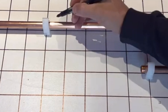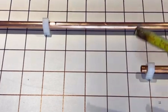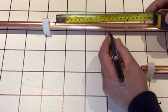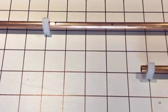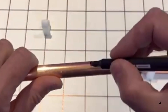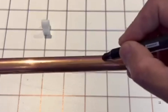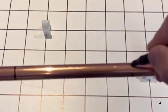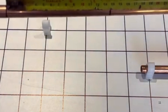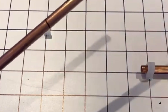Mark your reference point and then measure 140mm from there. Take that off, and I always mark around the pipe — it makes it easier once it's in the bender. There you go — you can see we've got 140mm travel line.